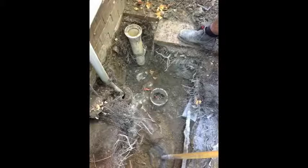We realized there was obviously an issue, and we knew that normally there are problems with food scraps in the waste pipe directly below the sink in the cupboard. We looked at removing that and had a look — everything was running fine from there. So we knew that there was a blockage further downstream.